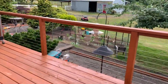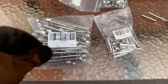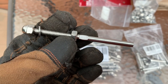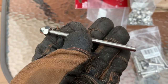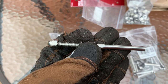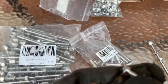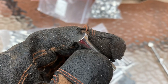Here are the parts we're using. This is made to accept a 1/8 inch stainless steel cable. It's just a nut on the end, or a nut cover, a nut, and then just a washer. These are about almost four inches long so they fit right inside the post, which is real nice. And these are the swages — I wanted a cleaner look so I went with these. They just get crimped on with the cable inside of there.